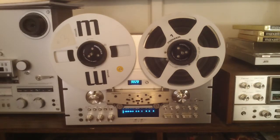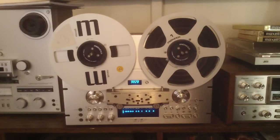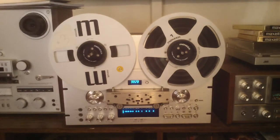It's over 100 electrolytic capacitors that have been replaced on this thing. The NEC op-amps have been removed and sockets installed, and Burr-Brown op-amps were installed. They're a better op-amp by far. Rotel uses nothing but these Burr-Browns — it's really good stuff. The NECs are just a very basic op-amp. And that's for playback, so you get a better sound out of these op-amps.